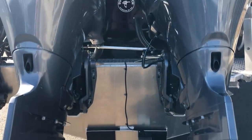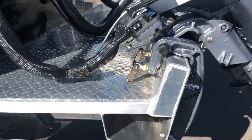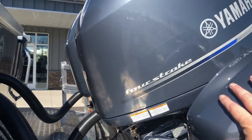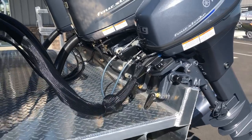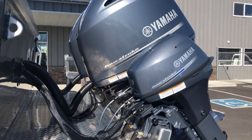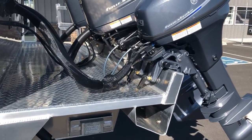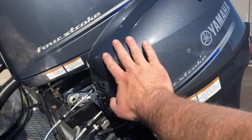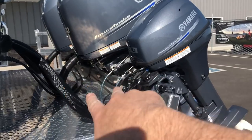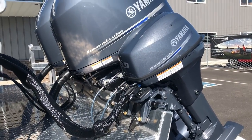Just a single transducer on this. He did a Lowrance system on this boat and then on the kicker setup we have a full remote kicker — a 9.9 — and these motors are all steered at slow speeds with Lowrance Outboard Pilot, which is a really cool system that works great. We have it on a number of boats. Instead of a regular TR1 autopilot that's just steering the kicker motor, the Lowrance Outboard Pilot is steering basically all three motors, so you have a much more effective rudder.